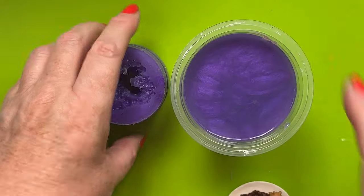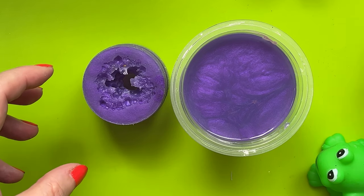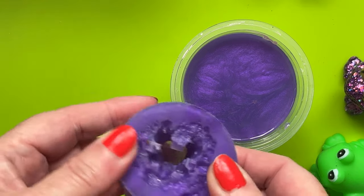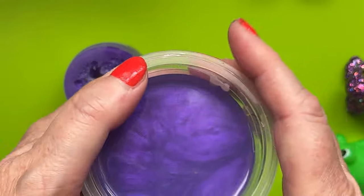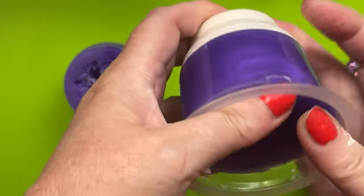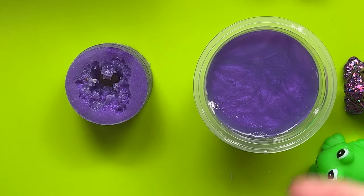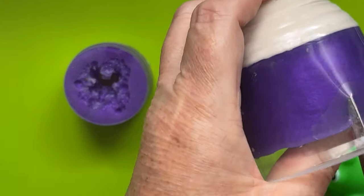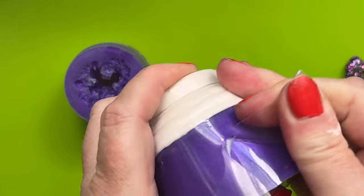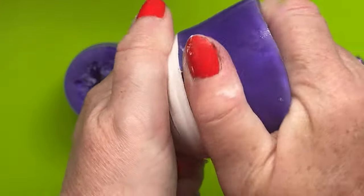Right then, let's get some demolding of the molds done. I've liberated the little dragon, and I haven't done the other one yet because the frog wanted to see. So we'll have a go at using this mold in a sec — let's get this one out. I'm going to loosen the sides slightly. This is just a yogurt pot — or was it a trifle pot, something like that. I'm going to cut down it because we may as well wreck it. Could get a craft knife and do it but this is just as easy. I don't want to score the outside of the mold, so I'm hoping I can get away with just that cut and then peel the rest away.